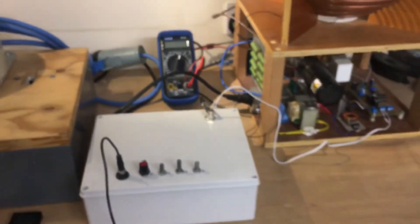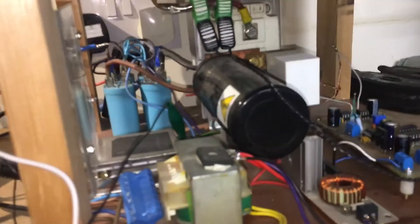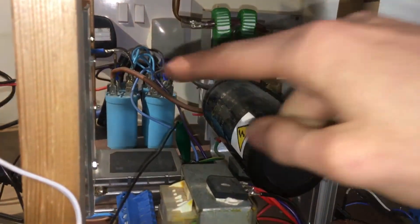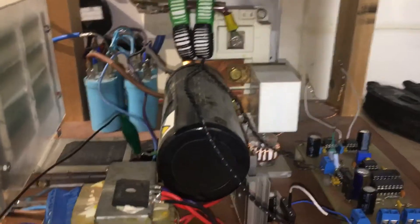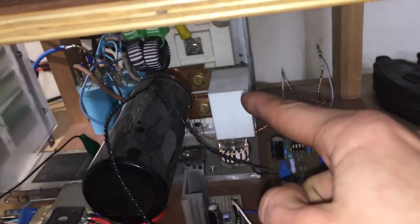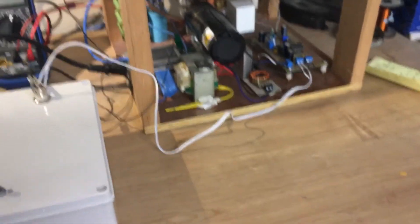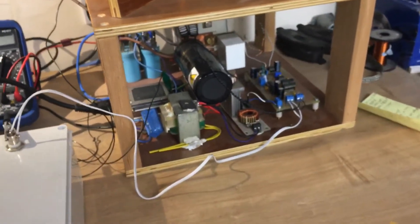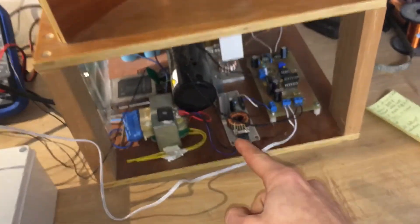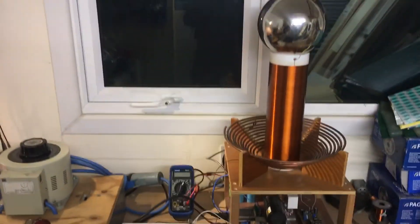What I'm going to do is have two capacitors here so this will actually be the voltage doubler here instead of the mess over there — saves a bit of space, although the capacitors will be bigger. That's a snubber capacitor right there, by the way — it helps suppress voltage spikes across the half bridge, helping to prevent it blowing up. And that's the power transformer for running the control circuit. That's the whole setup.